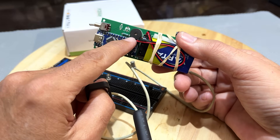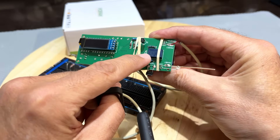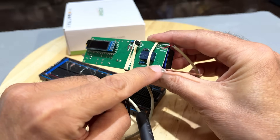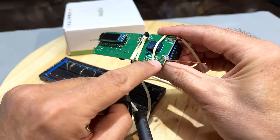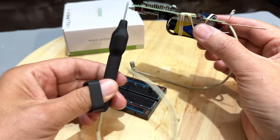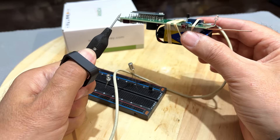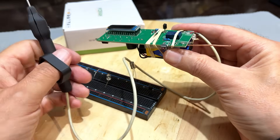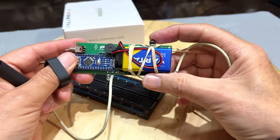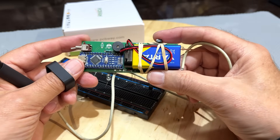I do know that these buzzers draw quite a bit of current - I'm not sure exactly how many milliamps. I know that the CMOS CD4066 I'm going to use draws very low current. I've got ultra-bright LEDs and at the moment I've used a 10K current limiting resistor instead of the designed 2.2K. What you were seeing was that LED being limited by 10K, which gives less than half a milliamp through these ultra-bright LEDs, and you can still see it very, very well. This is the phase that I love - I did three versions of the external BFO until I was finally satisfied.